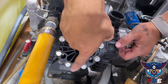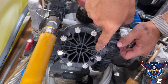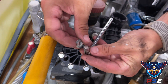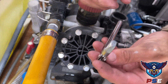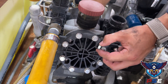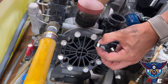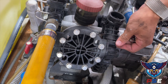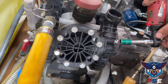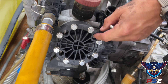There are four slots on each pump head, including four on the bottom. Take the keeper on the bottom at a 90-degree angle, either magnetize it or balance it, and push it up into the slot. You'll know which slot needs a keeper because there won't be one in there. What you're achieving is this bolt follows through that slot and goes into the keeper, and when tightened down you can see how it tightens up. That's what's happening on the bottom.